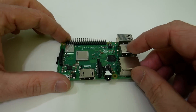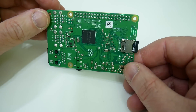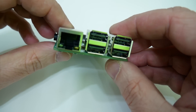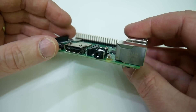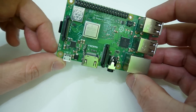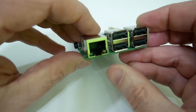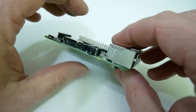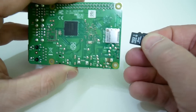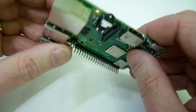The Raspberry Pi is basically a series of small single board computers — a credit card-sized computer that's got everything that you need on it, including an HDMI port, Ethernet ports, and USB ports. You've got space for a memory card, and there are modules for connecting a camera to it. And very importantly, there are some GPIO — general purpose input output — pins that allow you to connect LEDs, stepper motors, and all kinds of controllers, and you can do robotics with it. So really, it's a great board for that mix of software and hardware that you can do on one little board.